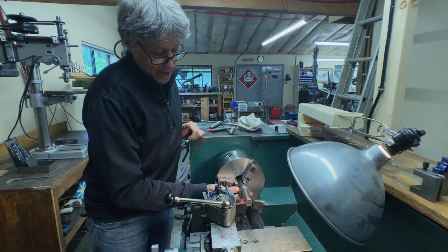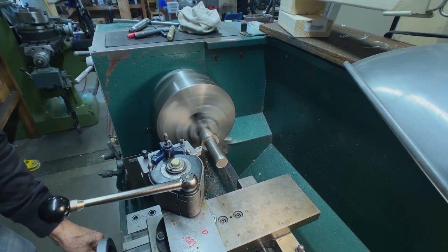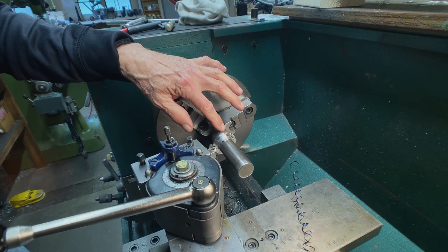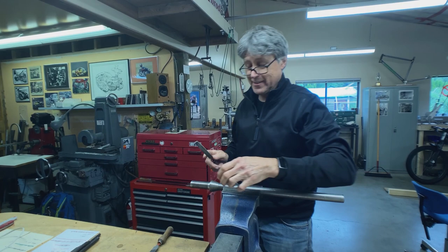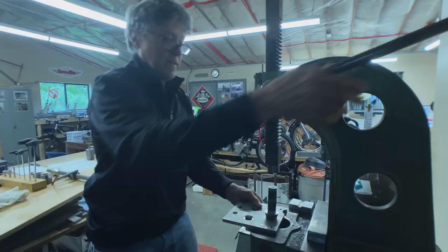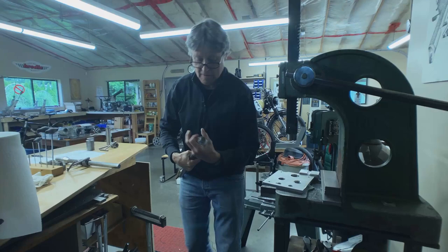I don't have to machine off the whole thing, but I'm going to take cuts going back maybe a quarter of an inch — going really close to this inch rod but not into the rod. You have to be careful. I'm very, very close. I think what I'll do now is file off the weld and then we'll go to the arbor press and press the shaft out from the taper. It's coming out really easy — I don't even need the arbor press. There we go.